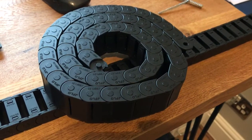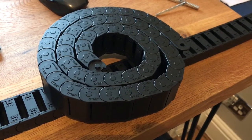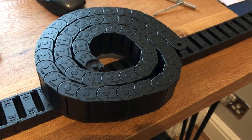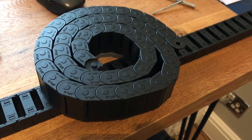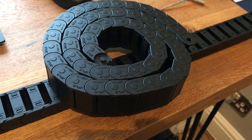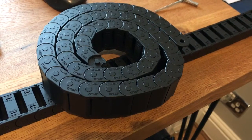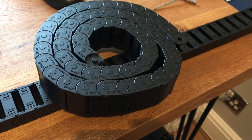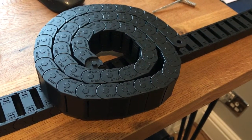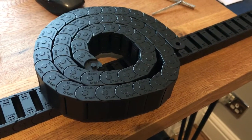I also have a water-cooled spindle and was getting water everywhere, so it's feeding pipework. And then the power cable for the water-cooled spindle — the spindle wire — wouldn't fit through because it's got a large connector on it. So I went and searched for more drag chains and ordered a load where it said you could open them. I went through two different sellers, waited three weeks overall, and every time I ordered, I found I would receive drag chains that I could not open.